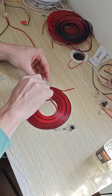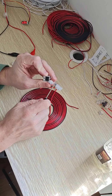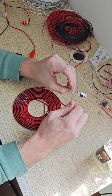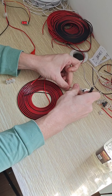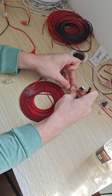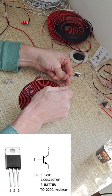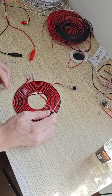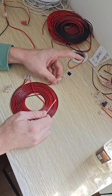So that's your positive into your circuit. Now I'm going to use a 1k resistor across the TIP31 base. And I take it from the outside of the coil — from the outside wire of the coil into the base. I'm using TIP31s; not sure why, I just got into them. I've got lots of other transistors — you could do it with a 2N2222 as well if you're using lower power — but I'm using 3 volts. So into the base there.